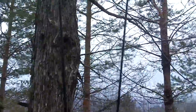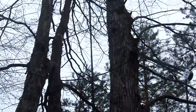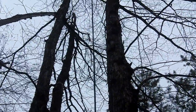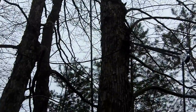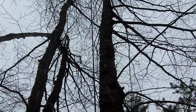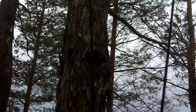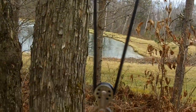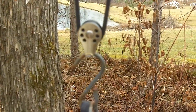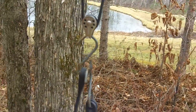It's really difficult to see, but this line here is going all the way up through a pulley that's connected to a stainless steel cable in the top of this tree. This is the Dacron line. If you could follow this all the way up, it would go through the pulley at the top and then over to the end insulator of the doublet. I've got that line coming down to a pulley here — it's actually a block because it's a marine pulley, so we call them blocks.